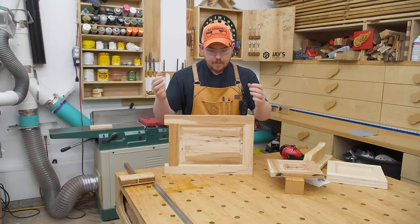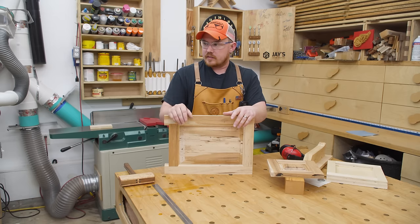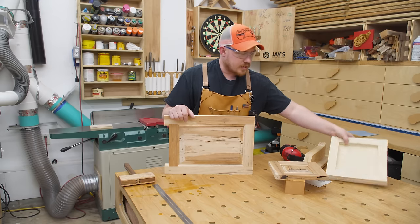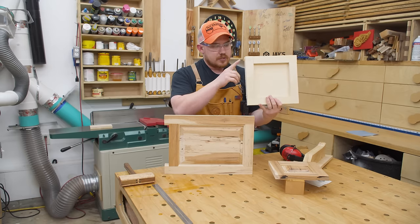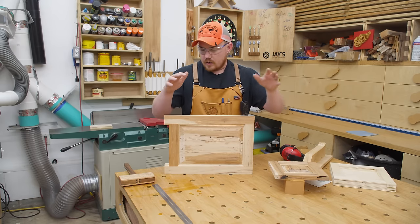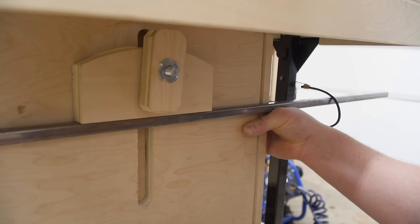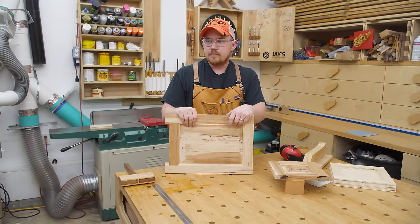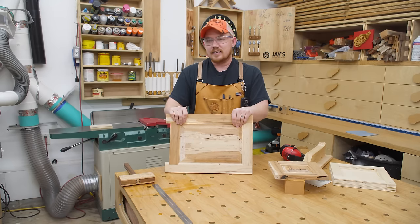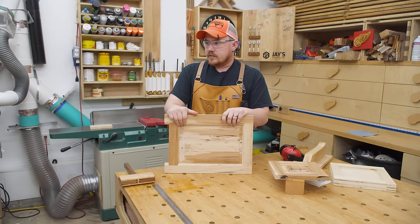This is my second raised panel door. The whole process is incredibly easy — I was very pleased with how easy it is to run a set of bits like this and make a door. I made a small one yesterday just goofing off, and it gave me the idea to build this simple square backer board, which will be handy for future setups. I made this video for two reasons: to get more experience with this router bit set, and to show that you can really dial in an exact height easily with that router lift. I get a lot of comments saying it doesn't seem easy, but it actually is very easy. If you're interested in more information on the router lift, I'll have links in the description.